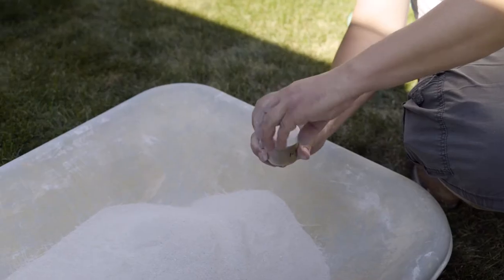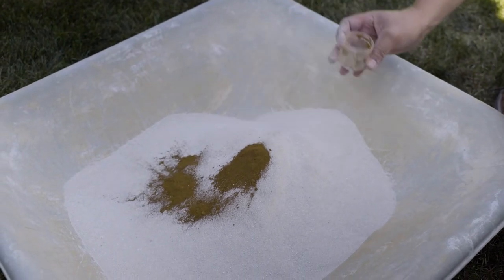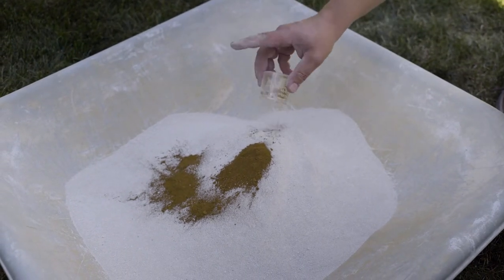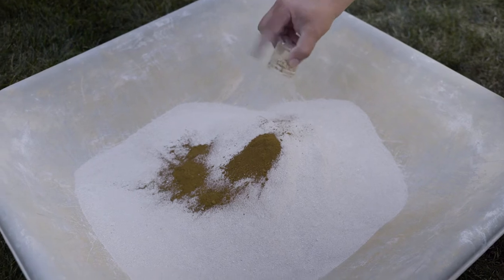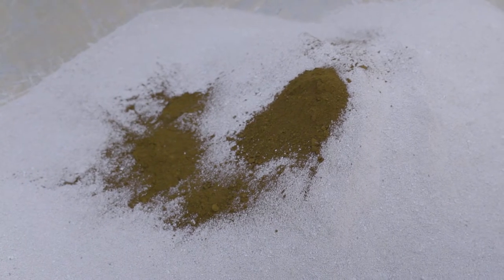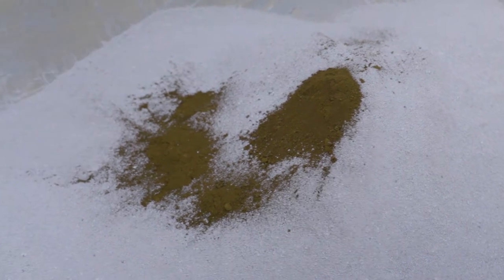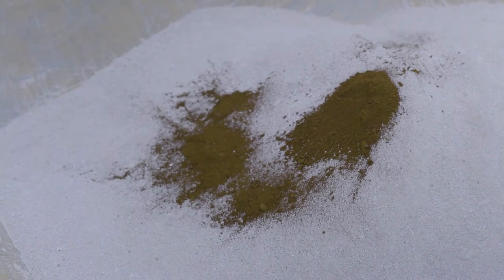We're using a coarse aggregate, and he's also mixing this mortar with a little bit of pigment — a buff pigment — just enough to soften the brilliant white color of the natural lime. Our goal here is to make this lime resemble old weathered lime mortar so that our spot pointing blends in with the rest of the wall.